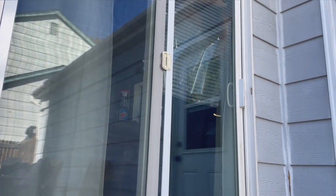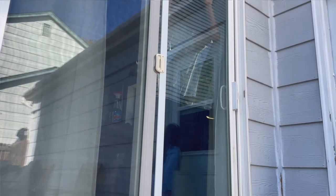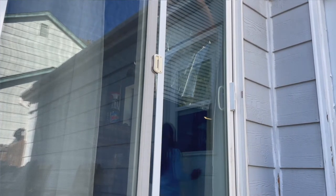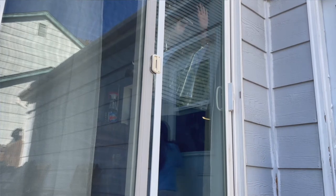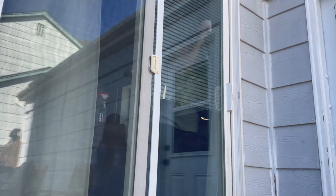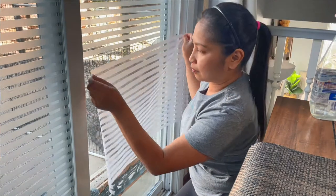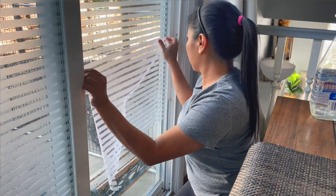Then lastly, spray the glass door with water before installing the film. I used a mixture of water and a few drops of dish soap to get a really good adherence. It helps to use a good squeegee as well to take out the wrinkles and the bubbles. Honestly, I just used a credit card.